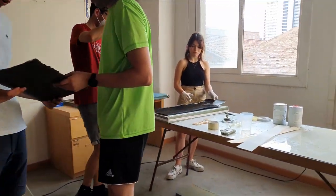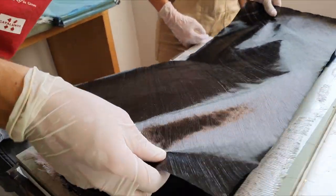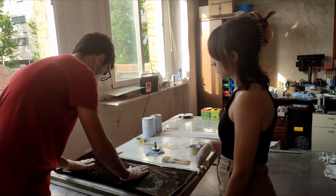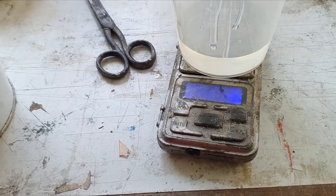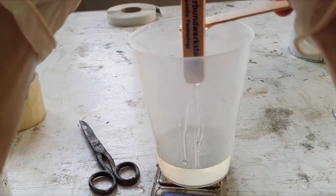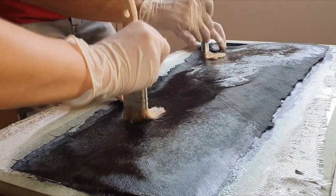In this video, we are laminating the structure of the wing using the previously prepared molds. Before starting the epoxy mix, it is necessary to check that all the components are ready and they all fit where they have to. It has to be remarked that the conditions were really harsh — we were over 36 degrees, and at that temperature not only the physical effect is high, but the epoxy hardens much quicker. So no time can be lost.